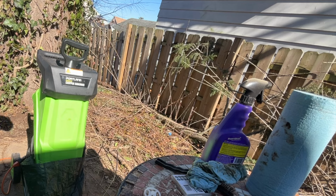Well, I could tell right away that is so much better. It was just feeding the wood right through like it used to when I first did it. So that cleanup is essential. And like I said, I probably didn't even have to flip the blades around, because it was probably just all the resin built up on those blades that was making them dull. And if I had just cleaned them off, it probably would have been just as good.